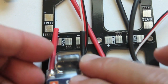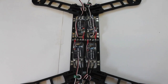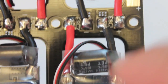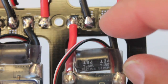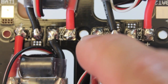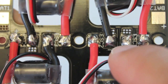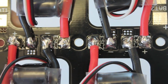It's a little nerve-wracking cutting your ESC leads so short. Our ESCs are now soldered in place. If you take a close look you can see what I was referring to related to staggering. You can see how short I cut those leads — if you do your power here and your negative over here, and vice versa on the other side, it makes it easier versus trying to cram all four leads together.